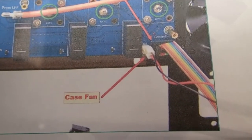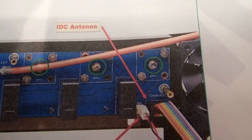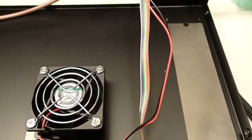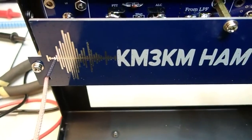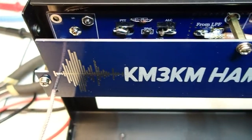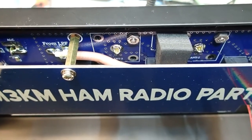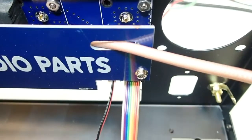The next step is to connect the case fan connector onto the board as well as the IDC antenna connector cable. With the fan and ribbon cable installed, the next thing is to put on the shield. The small piece of coax comes out on the bottom left, and the large piece of coax should be routed so it doesn't touch the antenna 3 SO-239. The large piece of coax comes out on the top right, and the fan and ribbon connector come out on the bottom right.